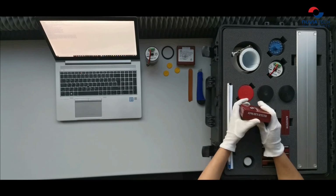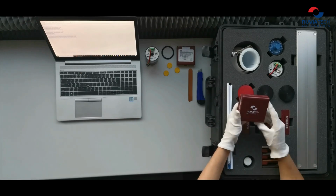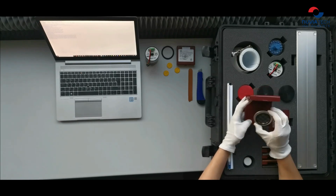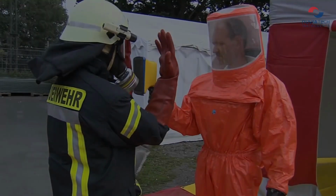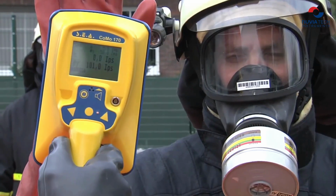Third one is this sandwich detector for both beta and alpha radiation measurement. The active volume here is made by thin plastic scintillator sprayed by zinc sulfide activated by silver. This is a very small detector. Usually the active area in real application is a little bit larger. These kinds of detectors are very widely used in alpha-beta contamination monitors.